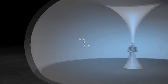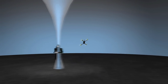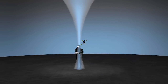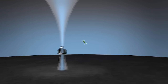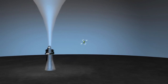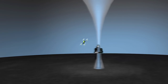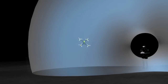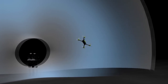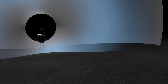Here's what's happening. It doesn't matter whether an antenna is a transmitter antenna or a receiver antenna — the radiation pattern is the same. Just as the transmit signal must reach the pilot, the receiver antenna pattern must also reach out to the quadcopter. Here we see an omnidirectional antenna in vertical orientation and how it's easy to keep the quad within that pattern. This is what it looks like if the receiver antenna is mounted horizontally — the quadcopter flies into the null of the antenna, making the signal weak, then gets strong again when it goes into the proper pattern.